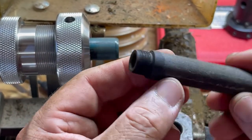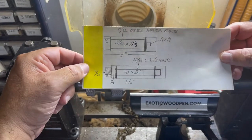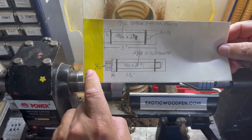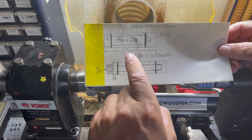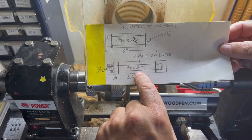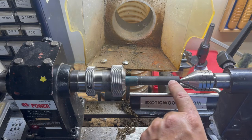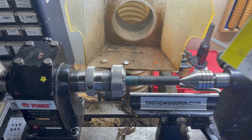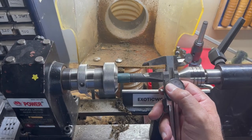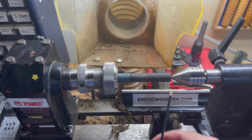This is what we've got so far. Let's chuck this back up and take a look. We already made the thread section here and drilled this out to three inches deep. We just need to turn this down to an outside diameter of 27/64ths from here down. I have my caliper set for 27/64ths, and now we'll go ahead and start turning it down.